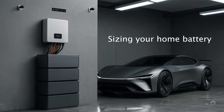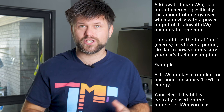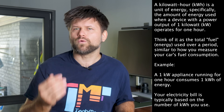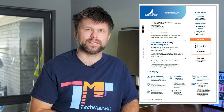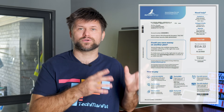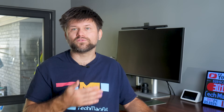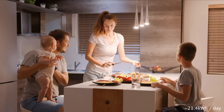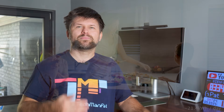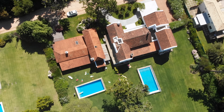So how big should your battery be? Home batteries are typically measured in kilowatt hours, which tells you how much energy they can store. Picking the size isn't one-size-fits-all — it depends on your usage and what you want the battery to do. Start with your average daily electricity use: check your power bill for the figure in kWh per day. In Australia, a 3-person household uses about 18.7 kWh per day on average, a 4-person household around 21.4 kWh a day, and five or more people roughly 25 kWh a day. But your own usage depends on climate, appliances, whether you have a pool or electric heating — it all makes a big difference.